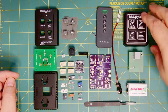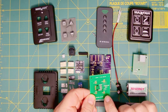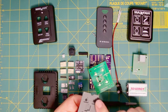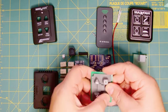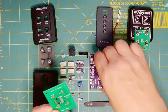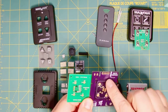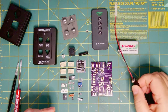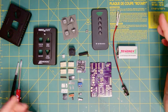The old one has two parts basically: the cover and the circuit board. There's a difference between the old and new circuit board. The new one has basically just an etched-in switch pattern that corresponds to these little carbon fiber contacts. The membrane sits on here, and as you push the button it makes contact. In contrast, the older style has actual tactile switches. Looking at the reverse of this circuit board, you can see that I've replicated the four switch contacts on the board that I made. We also have a 9-volt battery and a battery connector — even though this will be powered by 12 volts, we can use a 9-volt battery to test that everything works before we go into the RV.